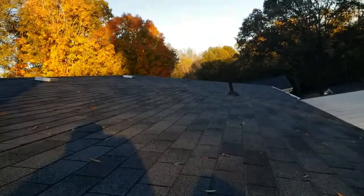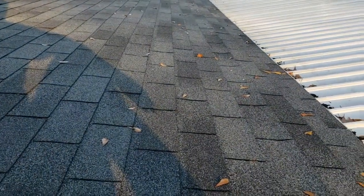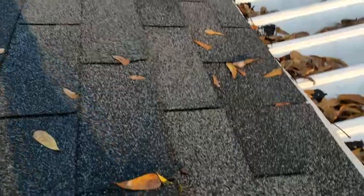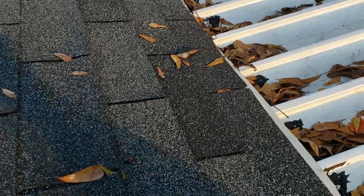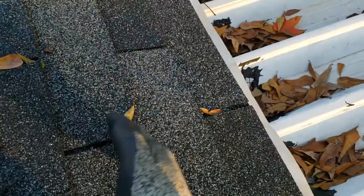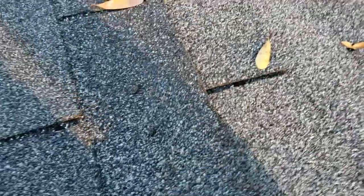Well, through time, if you look, you can kind of see the waves in the roof. It's tough to see, but there's waves in the wood underneath. The wood has started to wave up through heat cycles. Nothing you can do about it. So it's kind of flattened down right here a little bit. And this hasn't. This is actually the eave underneath the roof right here where it just falls off and goes to the ground, there's a slight eave, like a foot and a half or something, 18 inches. Anyway, this hasn't settled. This has been rock solid. This part did settle. And now it's creating an issue.